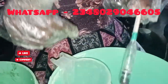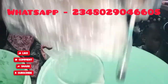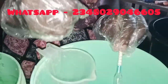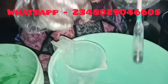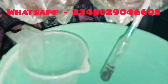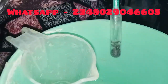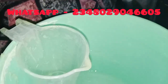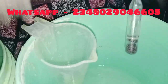When you're dissolving your caustic soda, don't pour water into it. Always ensure you put your water in first, then pour your caustic soda into it to avoid spillage — it can spill and cause an injury. Not just caustic soda, but any other acid like HCl or sulfuric acid: when dissolving in water, always pour the acid into the water, not water into it.